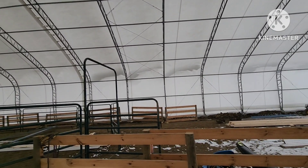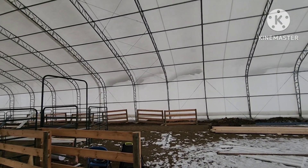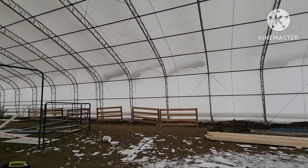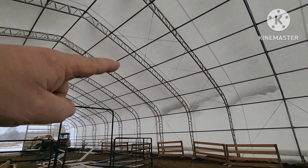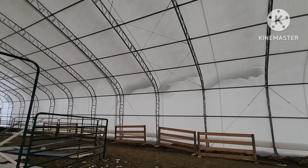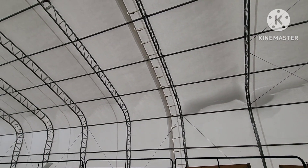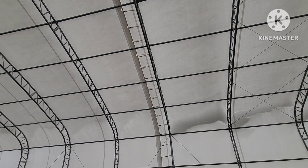There's over nine yards of concrete — actually for the end walls I had to come back with a couple more, so there's closer to 11 yards of concrete holding it down. That probably works out to about 1,000 pounds for each pier buried, with the bottom up to four feet in the ground. As far as snow load, that's probably my biggest fear. We did have a snowstorm where we had over a foot of snow on this section and it did make the fabric sag. You can see right now there is some snow sitting there, but that's just barely a dusting. That was a little anxious, but it took it. So far, so good. I can see I need to get up there and tighten a couple of ratchet straps that are loose.